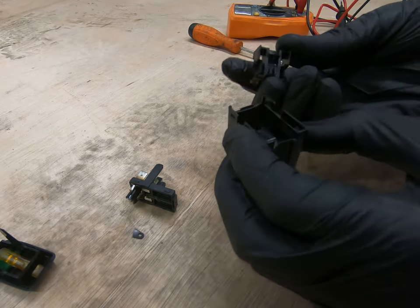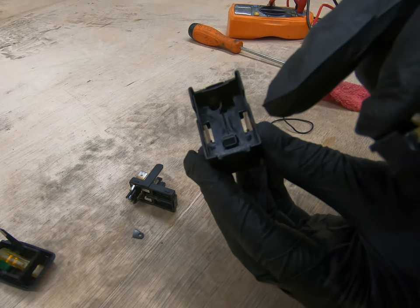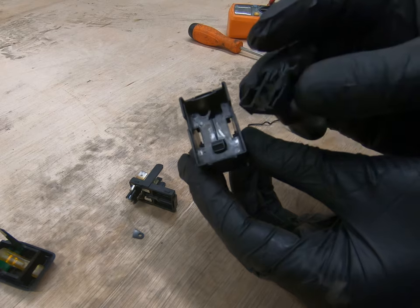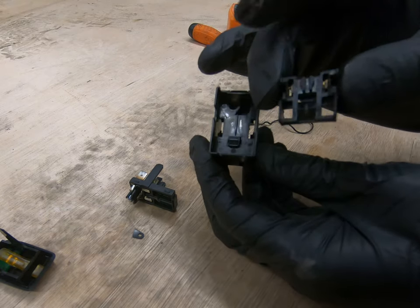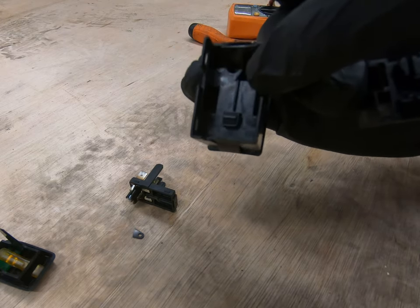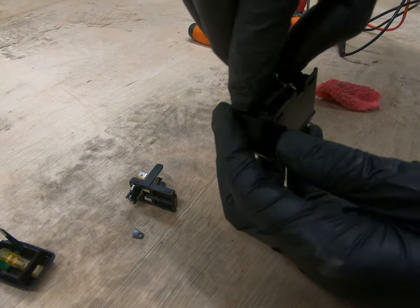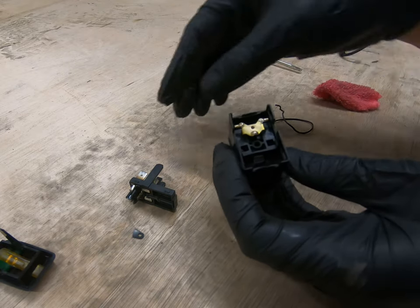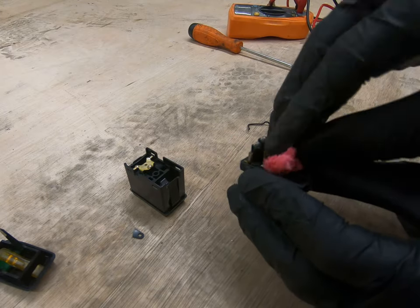How does this go back together? This goes in here this way up. Here's the body of the switch — you can see the sprung metal piece in the middle there. Let's call it a carriage. The carriage has got the triangular indent piece here, and I'm going to flip that over. There's kind of a groove in the centre of a peg, and there's a corresponding spine slideway in the middle. So when I put this round like that, that keeps the carriage centred. And this is where the detent is.